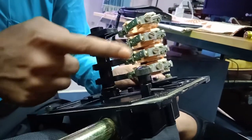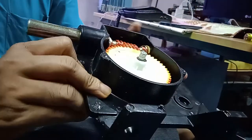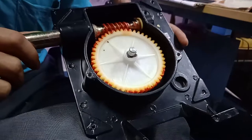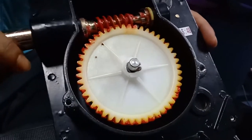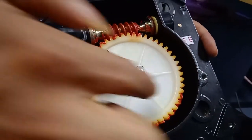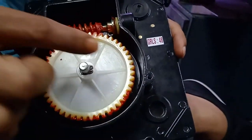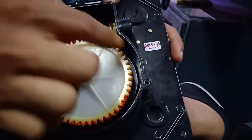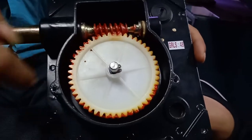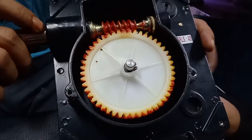There are four contacts here, so that's why four cams are there. On the back side there is one gear. This is your one shaft and this is your one wheel. If you rotate this one shaft 40 times, then this wheel will rotate one time. So this is basically a very simple mechanism.